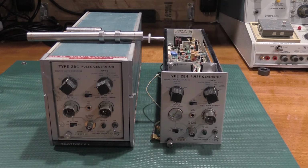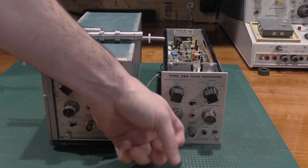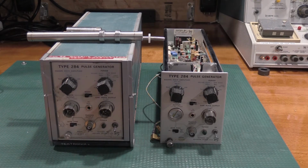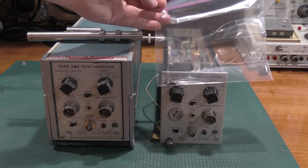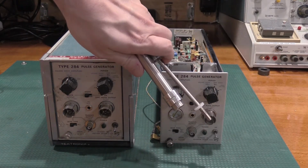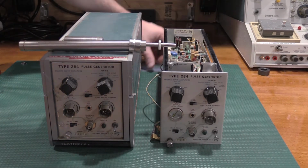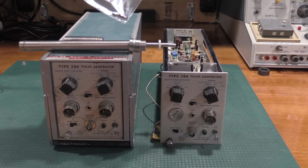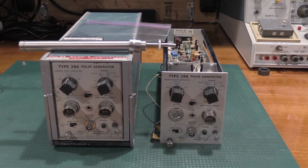This one I kind of know the story on. Everything's working on it except the important part, which is the high frequency square wave coming out with the 70 picosecond rise time. Right now I have these resistors, which I'll go into. These are part of the tunnel diode airline. This is an extremely goofy setup. They had to do a lot of pretty crazy things to get the 70 picosecond rise time to work right, so it's a little strange.